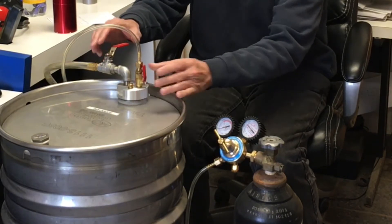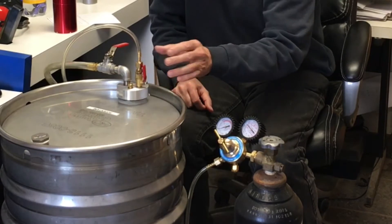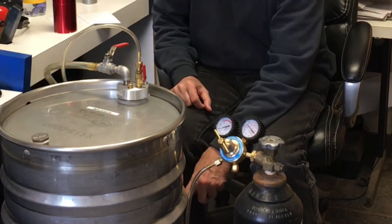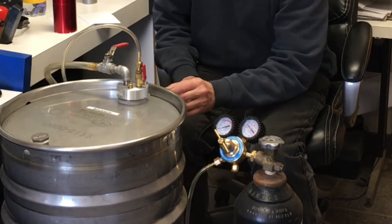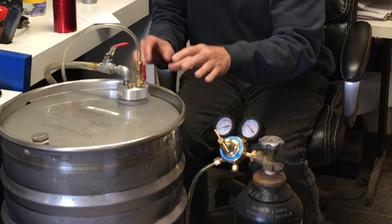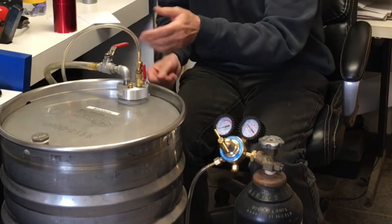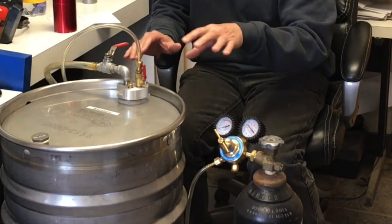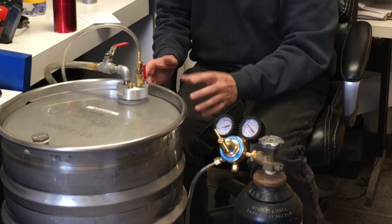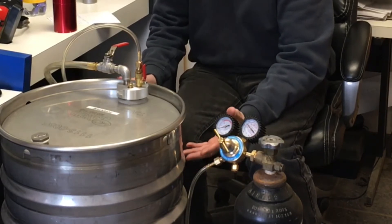This is the standard unit. It comes with an aluminum bung. There's a siphon tube made of copper — half-inch copper water pipe — that goes to the bottom. The nitrogen pressure on the liquid in the drum pushes it out and dispenses it without any outside air contaminating it or allowing any of the material to vaporize inside the drum.